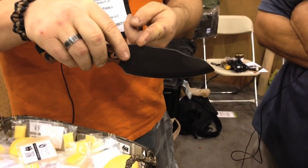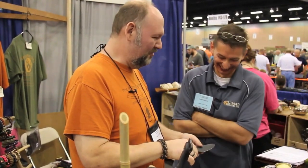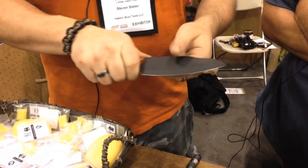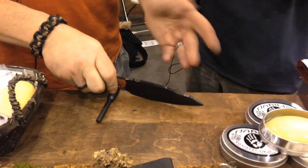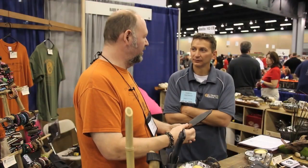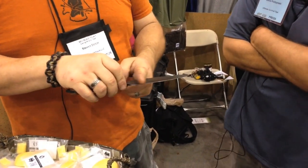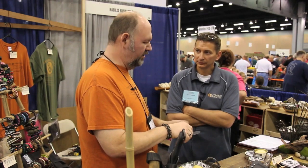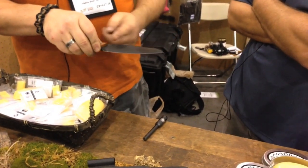This will also work to scrape down the hardwood foreshafts of an arrow so you can round one out and make sure it's not going to wobble in flight. At the back of the blade here it dead-ends into an integrated guard, so you're not going to have to worry about sliding up on it if you're getting aggressive with it. The nice point about that is it allows you to use it in a chef setting for food prep fine chop. This top edge is also easier to sharpen because you don't have a dead end to start from. If you ever wear it down to where it gets difficult to sharpen, you can do a traditional Scandi style sharpen — lay it flat on the stone, re-establish that bevel, put your secondary bevel back on, and keep going until you're out of metal.